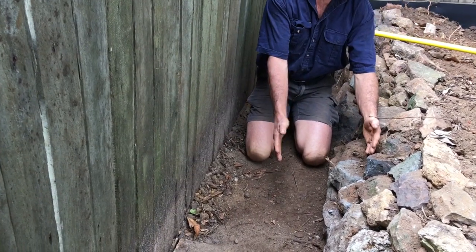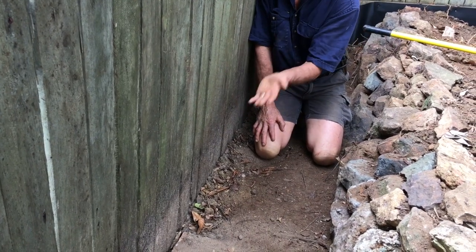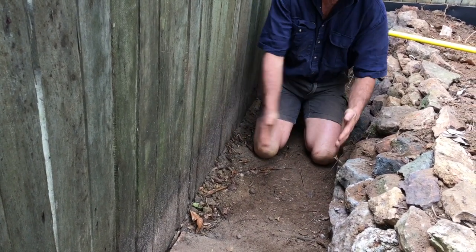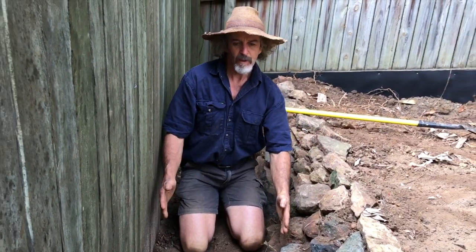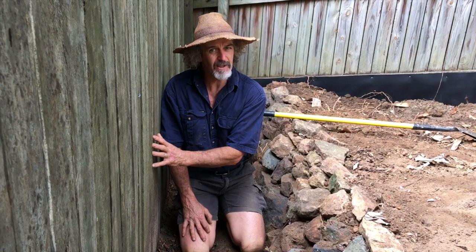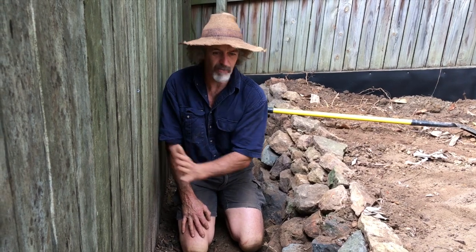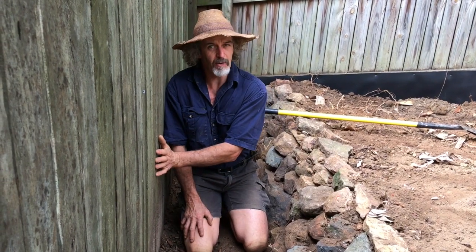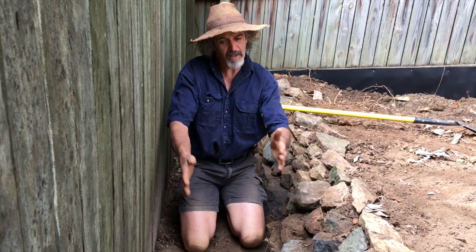You can see where the soil was against the fence and making it fall over. So I've cut back here — if I just did the retaining wall here, there's still material to fall down and push it over. We've lost a bit of space in the property, which is not ideal in an urban setting, but it needs to function. This fence is about 20 years old; we're going to get another 15 years out of it by doing this. If we'd left the dirt on there it'd have to be replaced, so we're saving the owners money and also creating space.